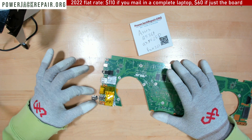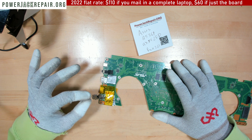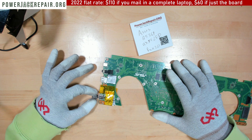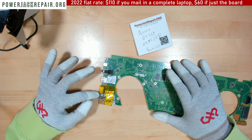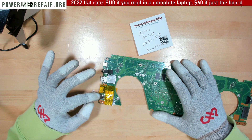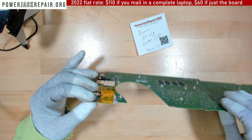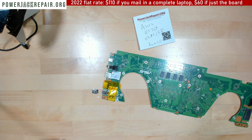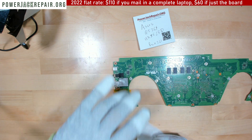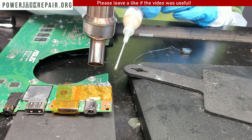Let me show you how I'm going to desolder this. The way to desolder it is you want to add some solder to the joints and then apply some hot air. Before adding solder you want to add some flux, then put some leaded-base solder — it'll mix with the unleaded-base solder. We'll apply some hot air and the soldering iron on top of those connections, adding solder on both sides, and using the hot air we'll be able to just drop it off the motherboard.